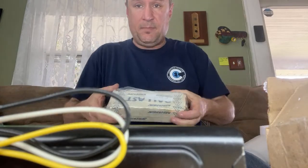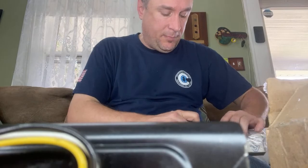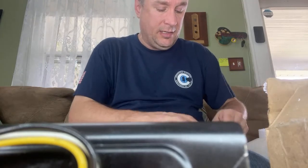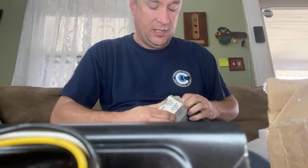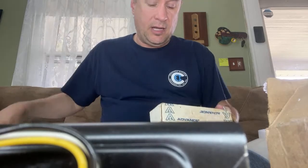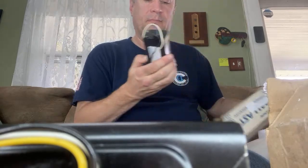Here we go. Yep, advance. Yeah, I'm stocking up on these things because these things are already discontinued, so if you like preheat fluorescent, you better stock up on your ballasts. Because if you have one go bad a few years from now, you ain't going to be able to get these. It's rare for a ballast to go bad, though. Magnetic like this. Let's see what kind this one is. Oh, it's got bent tabs again.